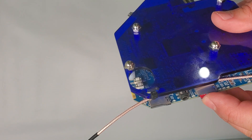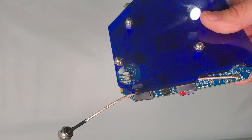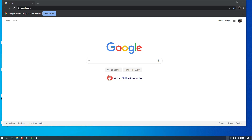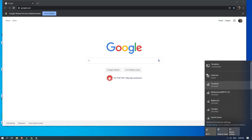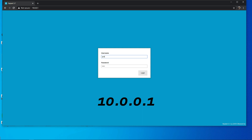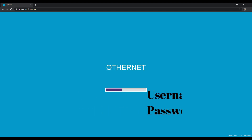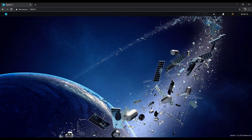Once complete, go ahead and remove the SD card from your PC and insert it in the proper slot in your DreamCatcher board and allow it about a minute to boot up. You will know the system is ready when you see a new SSID appearing in your available Wi-Fi networks — the name of the SSID is OtherNet. Go ahead and select it; no Wi-Fi password will be required. Once connected, open your web browser and type in 10.0.0.1. This will bring up the Skylark GUI and you will be asked to enter a username and password. The username is OtherNet and the password is OtherNet — that is the administrator account. If you enter guest as the username and password, you will have limited access and will not be able to perform any administrator functions.